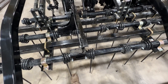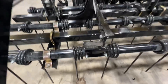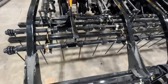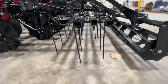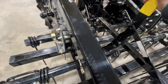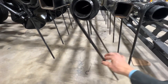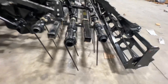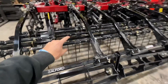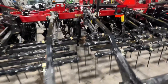As I push forward they get more relaxed, and as they relax they let more residue or dirt through. For example, if we're working in bean ground in the spring with hardly any residue, I'll pull this arm back and stand them straight up — they're pretty rigid in that position. If I'm running in the fall or in heavy residue, I push the arm forward and now they can relax. These things do an awesome job — they're long to handle the trash and they do a phenomenal job.